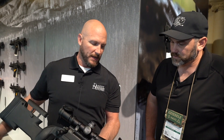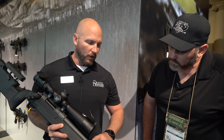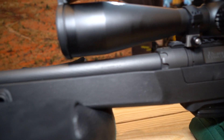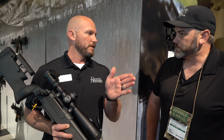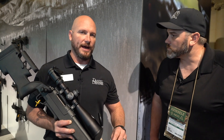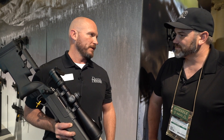There's a lot going on inside the action and the barrel system. Daniel Defense is known for our barrels. We cold hammer forged this barrel just like we do all of our other M4 barrels. However, we cold hammer forge and taper at the same time during the forging process. What that does is prevent us from needing to cut down or turn down the barrel after forging. When you do that, you relieve stresses on the metal and it causes slight warping or bending. By avoiding that, we have a very, very straight barrel, which correlates to a very accurate barrel.